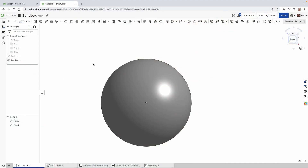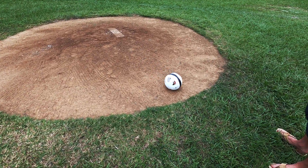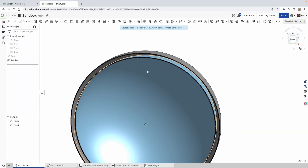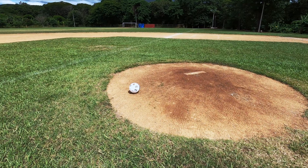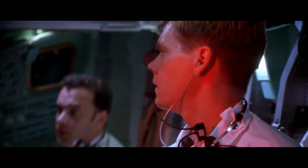The problem comes from when you increase the sphere size — the volume increases are exponential. The motor not only has to use the torque to move forward, but it also has to use the torque to start the rotational mass of the shell moving. If we increase the size of the ball, the forces very quickly go over the forces needed to move it. As our host would say in layman's terms: Wilson, you have a problem. What he's trying to say, in the words of Tim the Tool Man Taylor: we need more power.